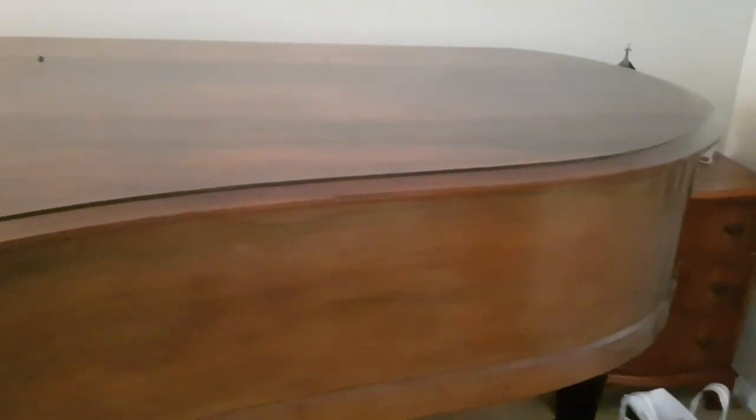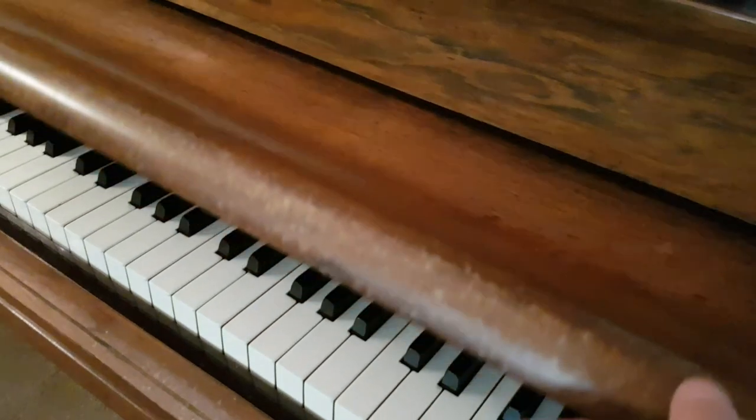The rest of the piano is quite typical faded rosewood really. The top is more of the original redder rosewood color. If rosewood is rubbed down it always darkens, so you end up with a very wonderful contrast in the grain. You can see some of that contrast here — other videos we've made show the French polishing process and how it ends up. The rosewood grain is very contrasting and very beautiful.